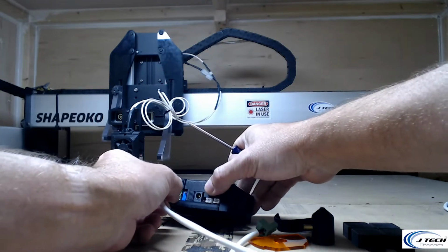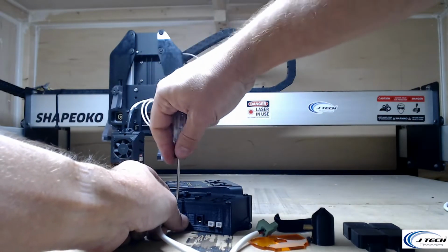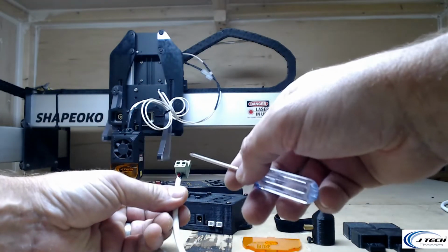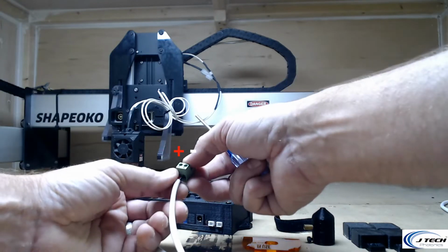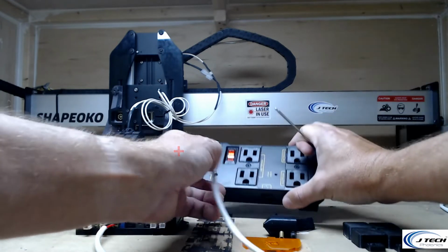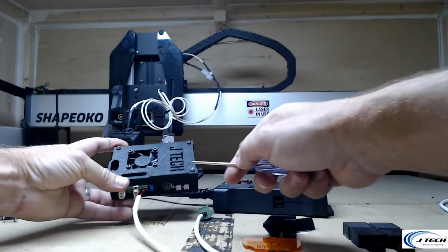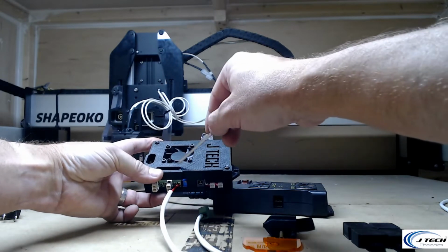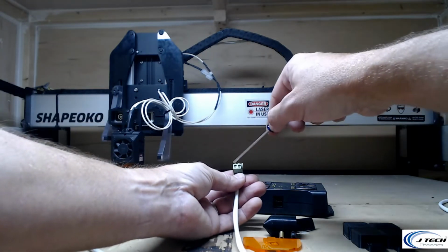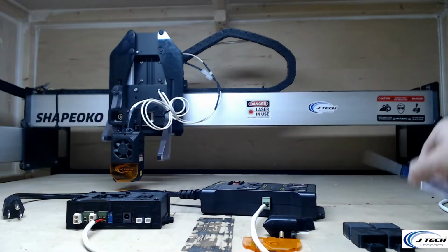It's a little thick wire because that's what we found out the relay really likes to have. It needs a little thick wire to be able to go into the other side of the screw terminal. So on this other side of the screw terminal, make sure the red is on the left and the black is on the right. You'll notice on it right here is plus and minus. It's a little reversed on ours: our right hand side's plus, left hand side's black. On theirs, right hand side's black, and red is on the left side. So you can just click that into there, and your Iot relay's all ready to go.